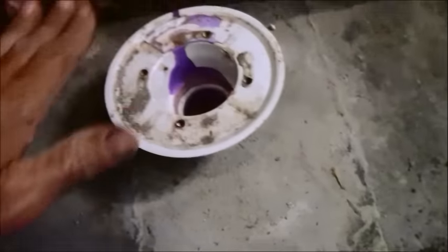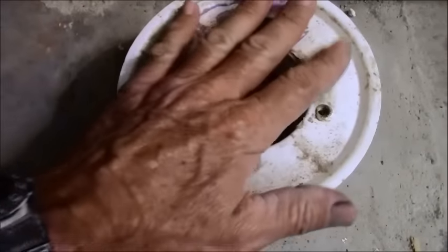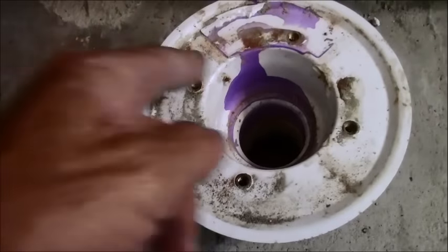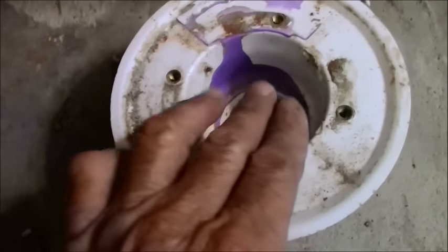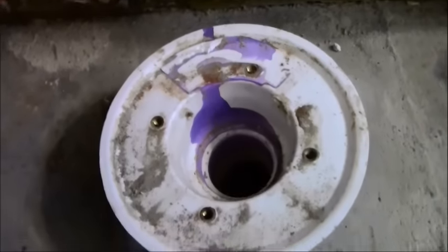As I said before, when I first started, this first flange needs to set flush on the floor. Then you put your pan liner on, and the pan liner goes over this top flange, and then I do little X's along here, put my bolts through the pan liner like that, and then I do an X right inside the center of the drain, not all the way to the edge of the drain, but just in the center of the drain, and then I'm able to get up under there and feel where the hole is, and then push my bolt through there.